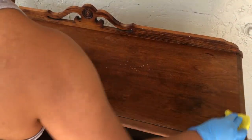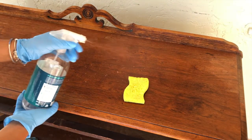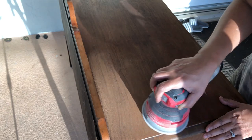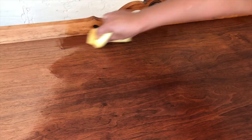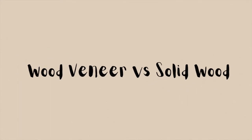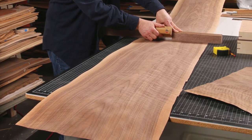Now let's talk about how to prepare each surface. Everything I've shared so far is to help you determine what kind of prep is needed for your refinishing projects. The most important thing you can do, regardless of the type of furniture, is to always degrease and thoroughly clean your piece. When it comes to solid wood, the advantage over its counterparts is the number of rounds it would allow you to sand and refinish — you can basically sand and refinish a solid piece of furniture over and over. Keep in mind though, stripping paint and stain can be very tedious. With wood veneer, it's usually less than 3mm thick, so although you can sand and refinish like a solid piece, there is only so far you can sand.